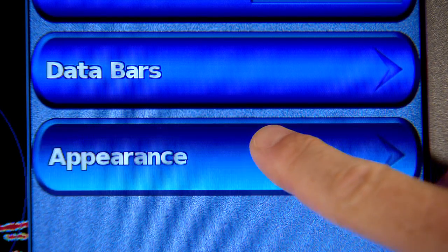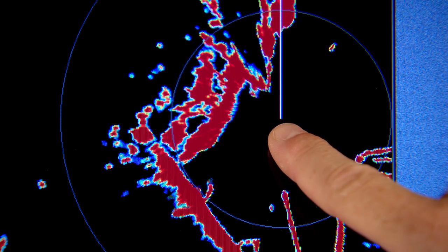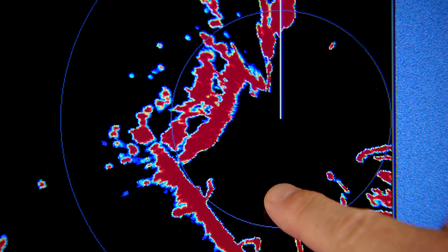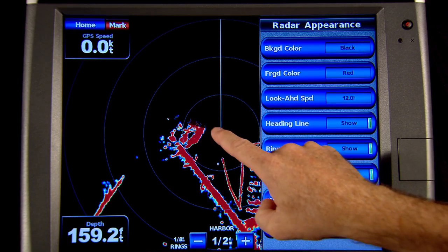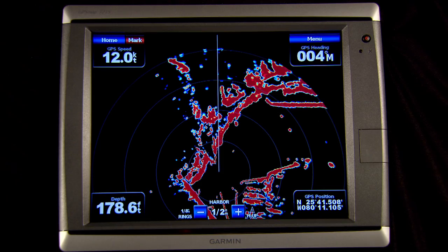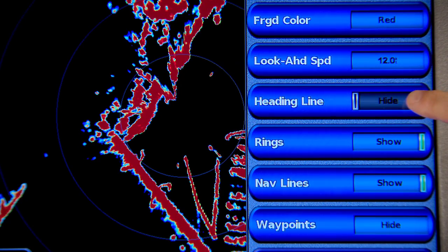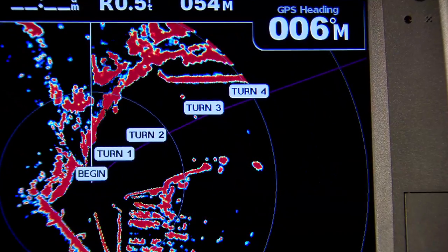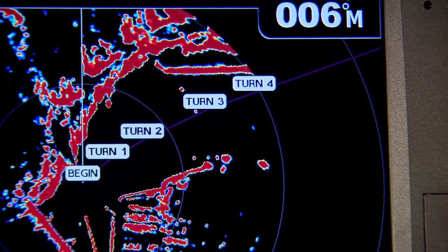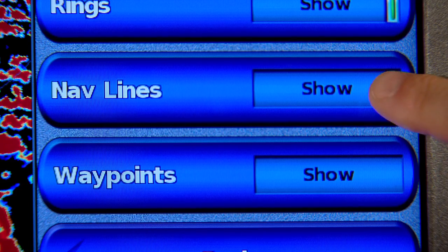Under radar appearance, let's look at the look ahead speed setting. Your boat is in the center of the screen by default, but if you're a powerboat going 30 knots you may want to see further ahead. Set the look ahead speed to, say, 12 knots — when going slow, your boat stays centered, but when GPS reports you've hit 12 knots, we shift your boat's position to show more water in front and less behind. You can also turn off the heading line and range rings. Garmin's integrated GPS and radar can show GPS navigational information — like the magenta course line and waypoints — on the radar screen, or you can turn them off here.